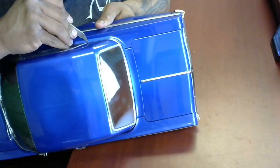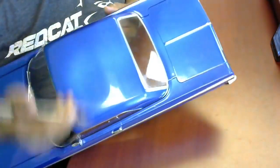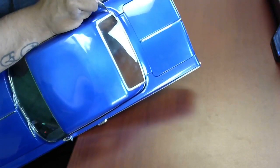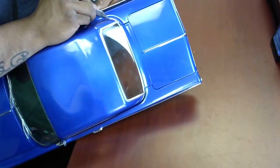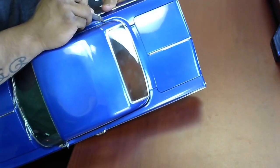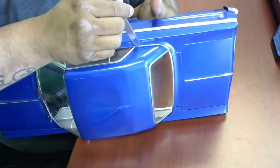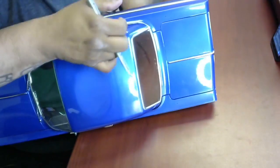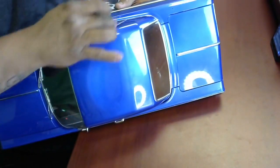Again, just take your time. You can see I'm doing increments of about two to three inches at a time. As you score more and more, the plastic will get thinner and thinner, and at some point you will end up cutting through it. Like that — see, the blade went in, which is what we wanted after all that scoring. Now I know I have a protrusion right there and I can start working on stretching the Lexan to start manipulating it. Just keep scoring — it's going to weaken it more and more.